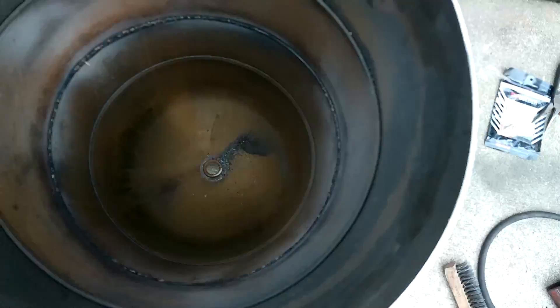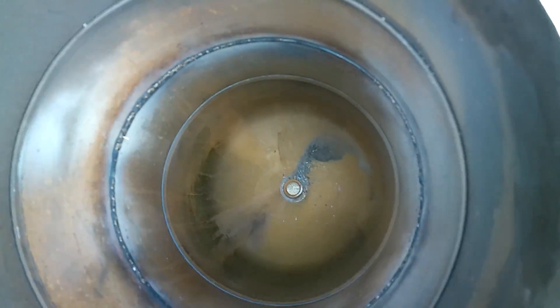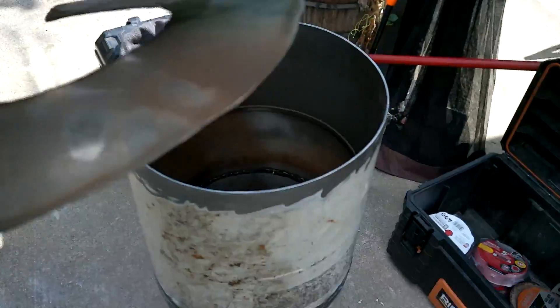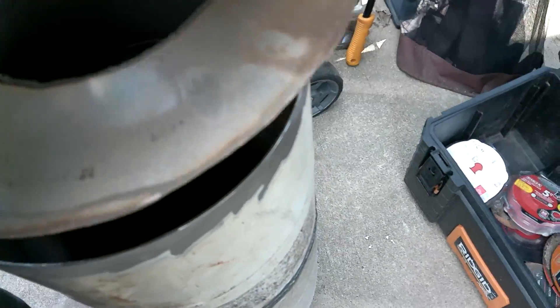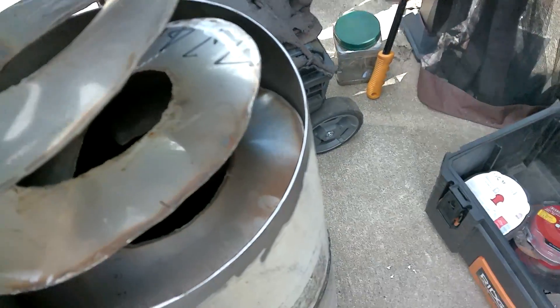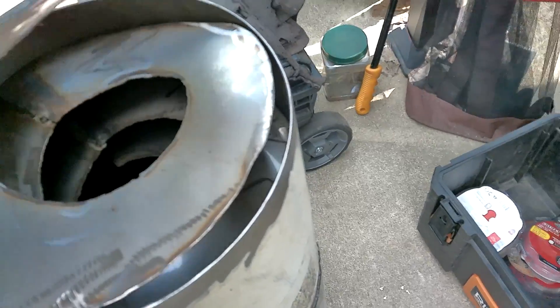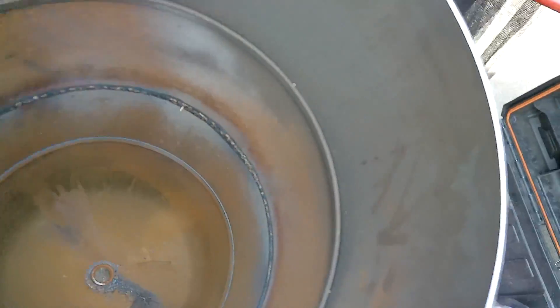Here's how she looks on the inside. As you can see, full penetrating weld all the way around, just like we want to see. Now that does lead me to this next point — you see these rings here? These are going to be an issue. These auger blades fit perfectly to the diameter of these propane tanks — like perfectly — but those internal rings they put in there block them. These internal rings are on the other side of the actual machine weld on these tanks.